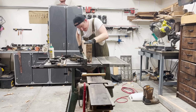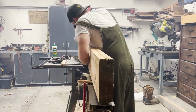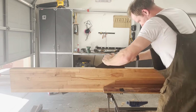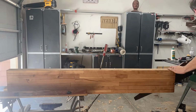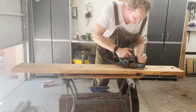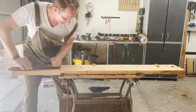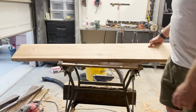Now, after all that, I'm going to split this board as well. I learned a lot from the last process. I stuck with one saw this time, a traditional style saw that was large and stiff enough to keep from wandering. And I started from one end to the other. Oh, and I sharpened it too. That helps. Turned out much better this time. A bit of planing and flattening, and the well board is cut to dimensions along with the two top slabs and aprons.